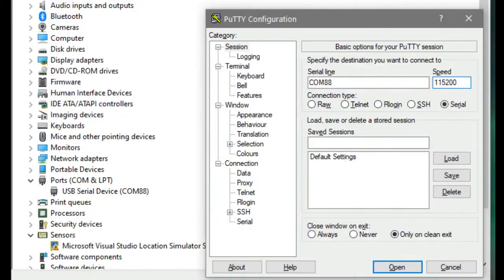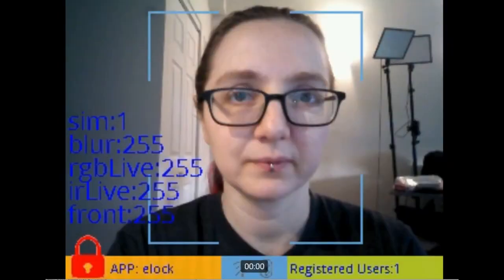So if you take that USB-C and plug it in, this shows up as a COM port and a camera. It actually shows up as a device because it's a microcontroller and it can do stuff like that — you don't have to deal with gadget mode with Linux, it just shows up as literally a camera. You open up your camera software, like Microsoft Camera, and it comes up with the visual output of what it's seeing. There's a blue square in the center telling you this is what it's looking at for the face recognition area. With debug turned on, there's a text overlay showing the output of the various processing stages. On the bottom, it tells you what the application is — this is the electronic lock application where, if it recognizes a face, it unlocks something.